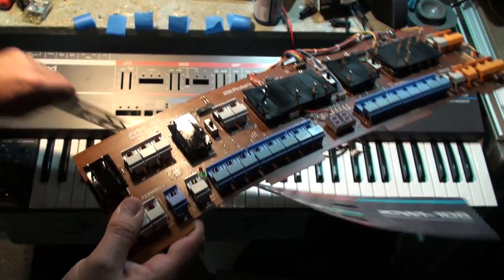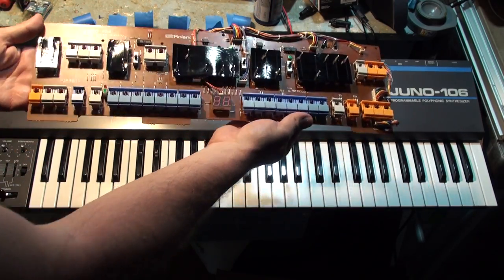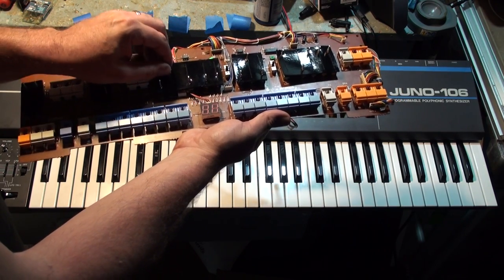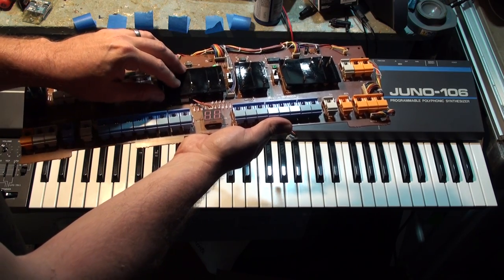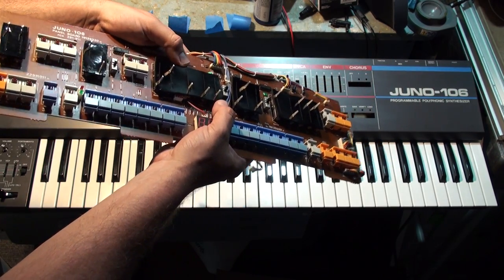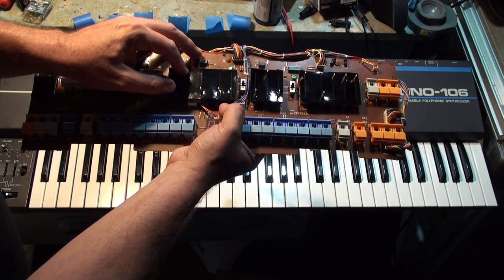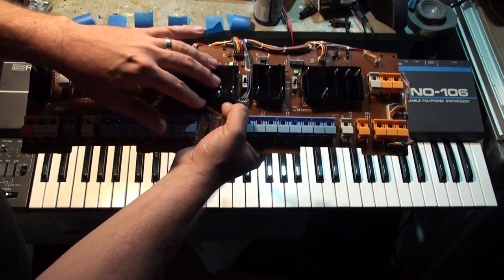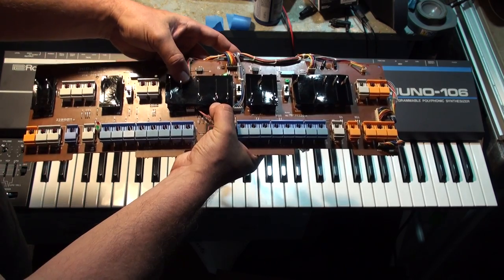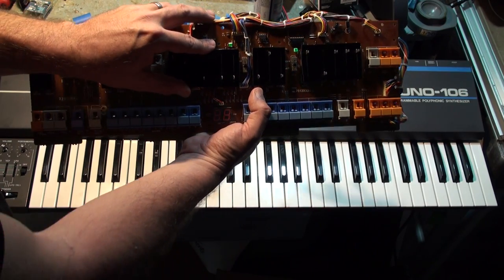Part of my process is to actually service all of the faders, and the ones that are janky get taken out and dismantled and reassembled, and relubed, and then I have these custom neoprene covers, which I have a new technique for now. I'm using a computer-controlled plotter cutter to cut what's basically waterproof vinyl. And then the waterproof vinyl provides a completely accurate template for the neoprene that goes underneath. So this is actually neoprene with waterproof vinyl on the cover.